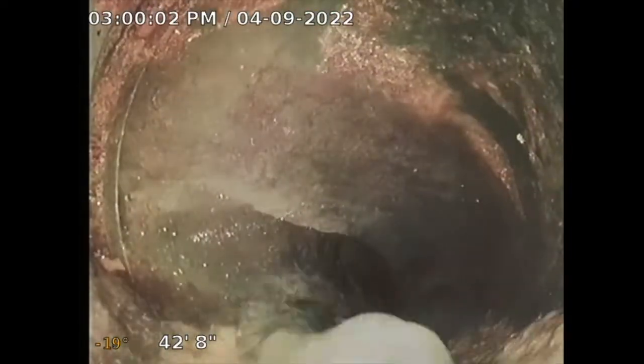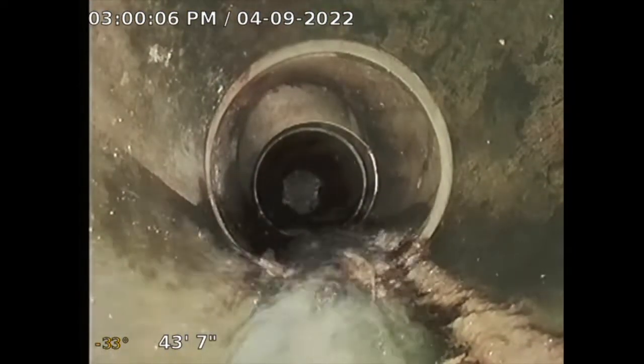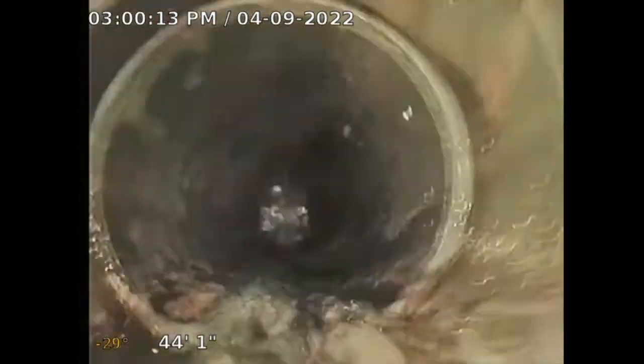Here's a transition — it's going to turn down. On the slope it appears serviceable. I have a 34-degree reading here; you can tell it's sloped. There's another test T in the front. Clean-out is located at the front next to the water meter.